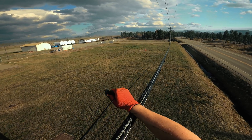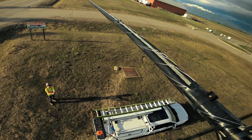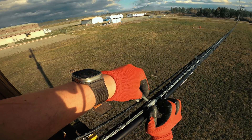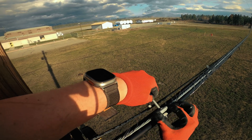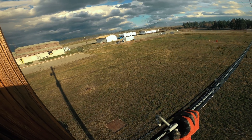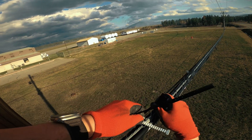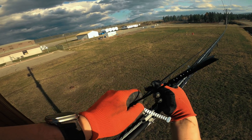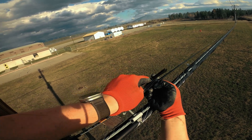Okay, drop. Hold there. Get a clamp on. This is how I tension long spans — you put it on enough so you can move it, get your hanger, get it put on. This is an easy example because I have a helper around, but normally I work by myself.